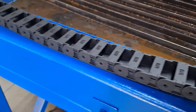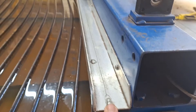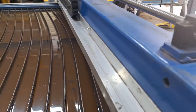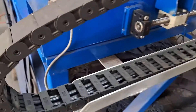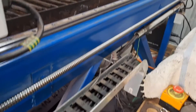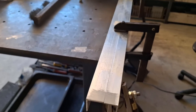This is the drag chain I'll be using for the machine torch cable. Around the back of the gantry I already have a channel for the original drag chain with the motor cables. I'm going to build another one on the back here and weld the two together, which will give me enough room to run the second drag chain. Once I've done the gantry one, I'll come around to the side where there's already a drag chain with cables — I've just got to duplicate that and run it down as the carrier for the machine torch cable. I've got two pieces of aluminium angle and I'm going to TIG weld them together to make the tray for the drag chain.